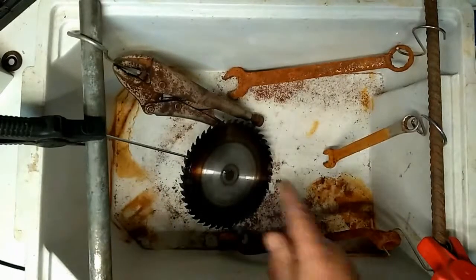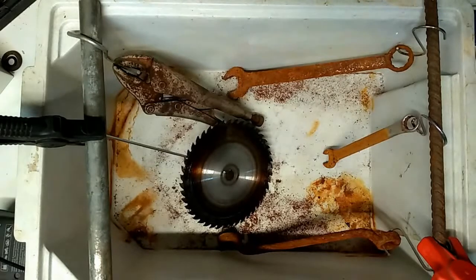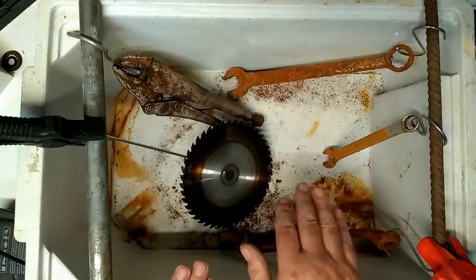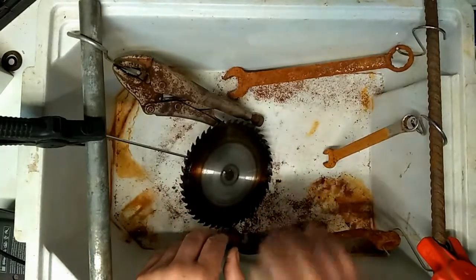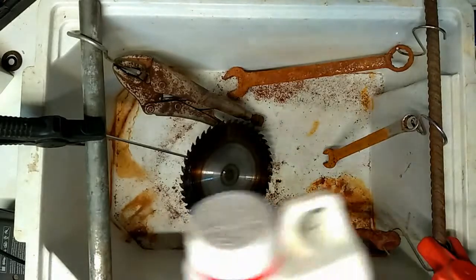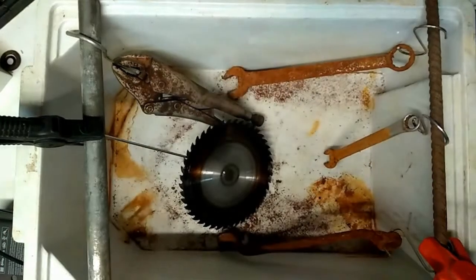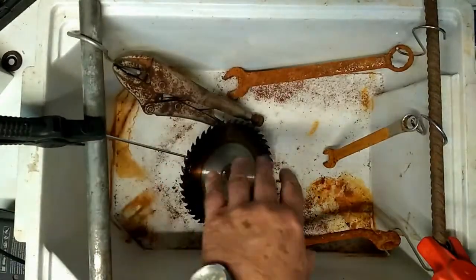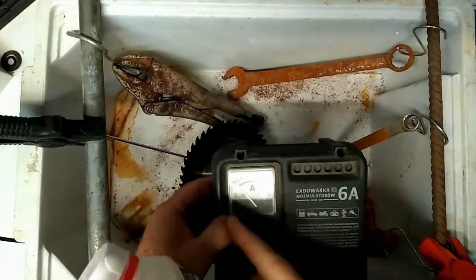The problem is that to get the current supply that you want - a couple of amps is fine for me - fresh water is an insulator, pretty much anyway. So you put your water in here, turn this on, you'll get hardly any current to flow, so it will take forever. What is recommended is to use sodium carbonate - washing soda - and just sprinkle it in. The salts reduce the resistance of the water and you can see on the ammeter as the current starts flowing.